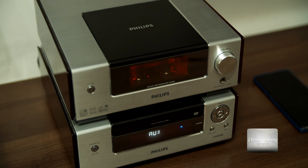The differences are not huge, but you can sense them. If you are paying attention to the sound, you will hear that the 12AU7 — these new tubes — sound good. But there's a catch: even equalized to the same level, the 12AU7 has a smaller volume — about minus two decibels compared to the 12AX7.